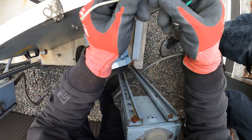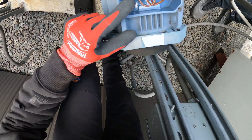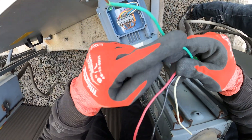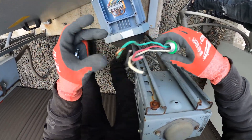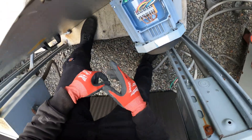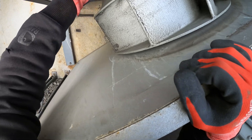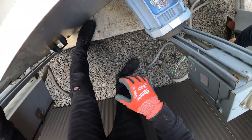I just disconnected the electrical. We got our three phases: white, black, red. White went to U1, red went to V1, black went to W1 — and I just cut that out and took it out. The green wire is our ground. So now our electrical is out, and the only thing holding us in place is this mount and this blade. Once we take this apart we can free this motor and do what we can.